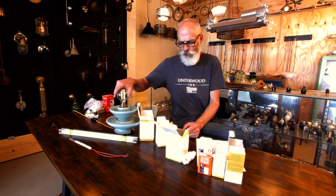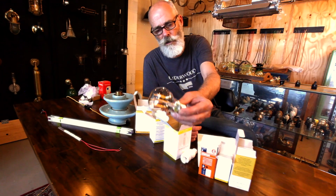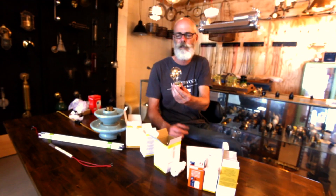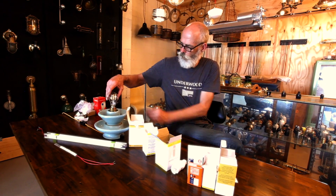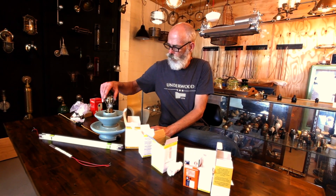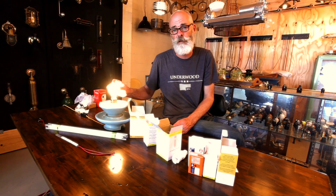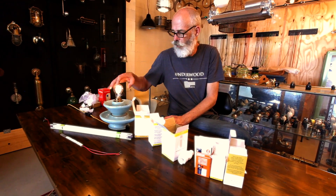We used those for probably two years and then things changed. We ended up with what is an LED strip. These strips were mass-produced in specific lengths, so we would put them all together into a little group — in this case a little screw cage type sphere to look a bit like a vintage globe. We were using these again for decorative lighting purposes. This one is particularly warm but reasonably bright, and again only five watts, so for the amount of power being consumed they're fairly bright and quite high efficiency compared to older technology.